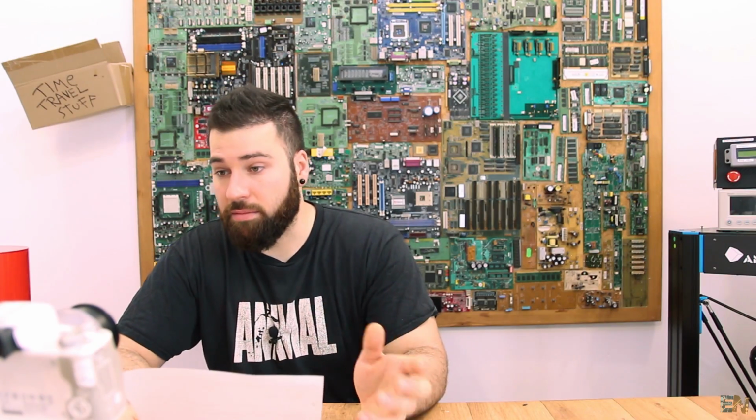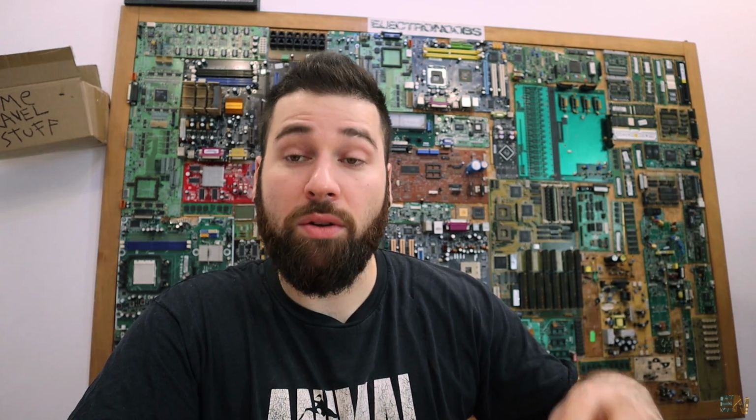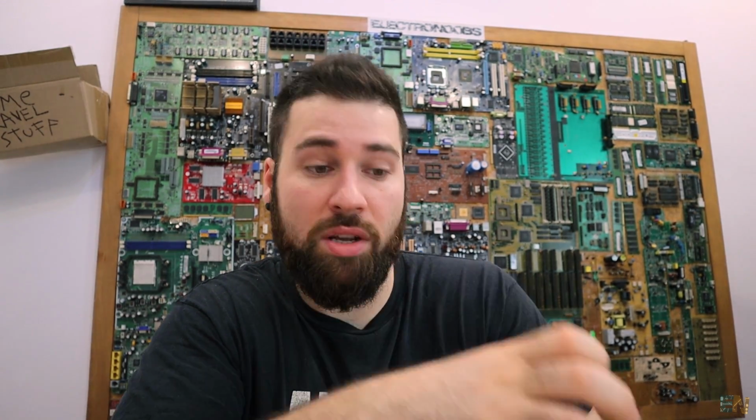Then you will need a lot of MOSFET drivers, because when you work with electronics you will use those MOSFETs a lot, but usually you will use the MOSFETs at a higher voltage, higher frequencies, and directly a signal from a microcontroller won't be enough, because usually it's 5 volts, and at high frequencies the gate might not be fully activated. So that's why we use the MOSFET drivers. You could use a BJT as a driver at the gate of the MOSFET, but it's not as good as a dedicated IC for a MOSFET.